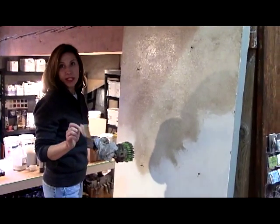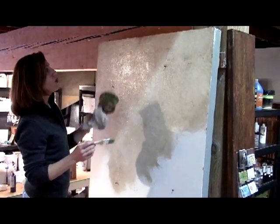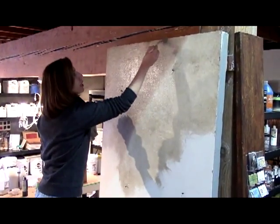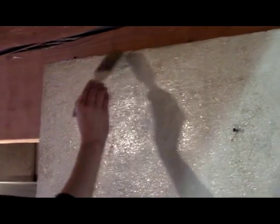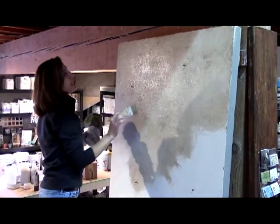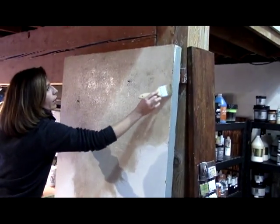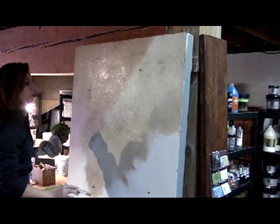One of the other tips in technique when you are one color glazing is that after you put the glaze and you kind of pounce it up in there, you take your little chip brush and run right along in your corners so that it blends out evenly and you don't have heavy puddles of glaze in your corners. That is a definite trait of an experienced glazer — that you can get your corners just as smooth looking as your wall finishes.